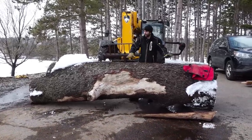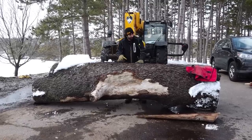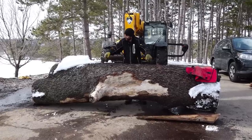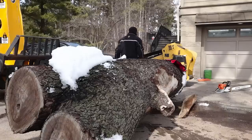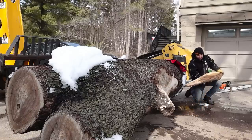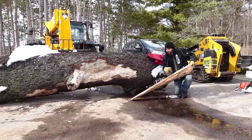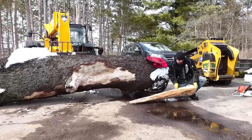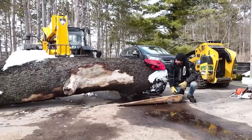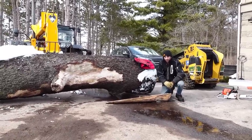And that's gonna give me more yield out of both halves of this thing versus trying to saw it like this. If I saw it like this, it would be kind of cool because the first two slabs would have live edge all the way around. They'd be kind of oval shape as you get down there. But then as you get to the bottom, you get partial length boards. You'll end up with stuff that looks like this, where you have basically a giant tapered wedge thing and you have live edge on the top of it. So it's kind of weird, goofy shapes. So as far as usability goes, I'd rather have normal-ish boards with end grain on them. So you can just cut this thing in half and then we'll process both halves as their own individual logs.